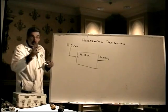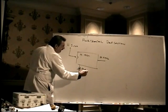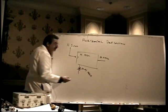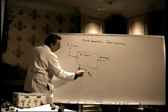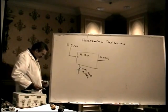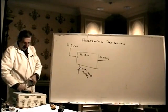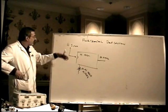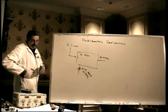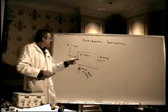And just as it was with the vertical circuit, if you are adjusting the horizontal hold control, which might be referred to as horizontal frequency in some monitors, you're adjusting that frequency, and you get it kind of in the ballpark, and the sync will come along and lock it in place, which we know doesn't work in this particular monitor. Okay.